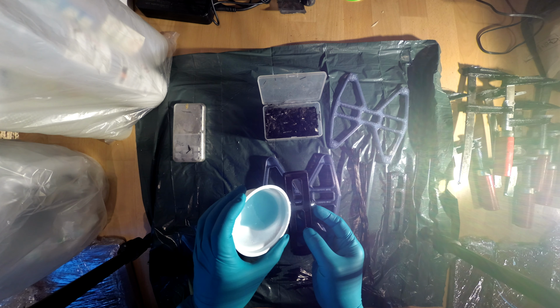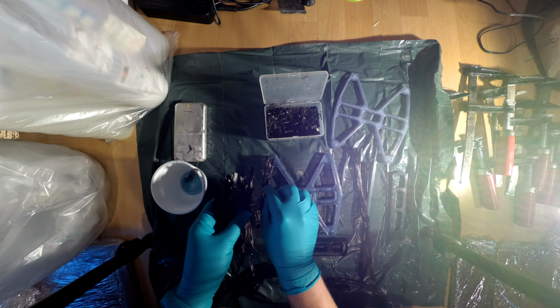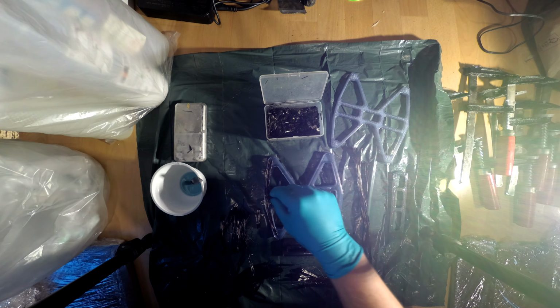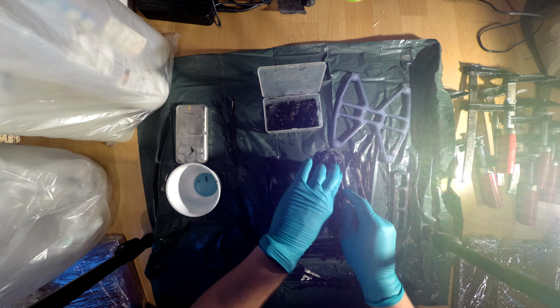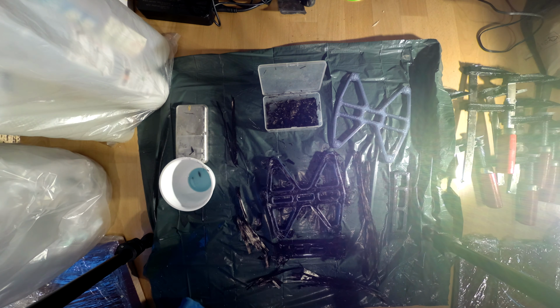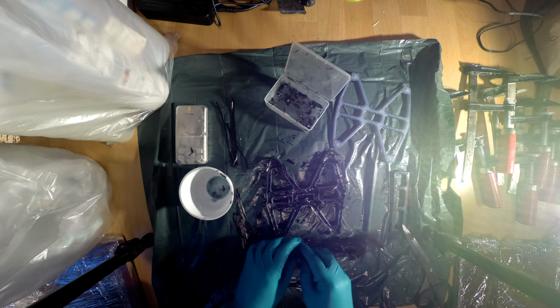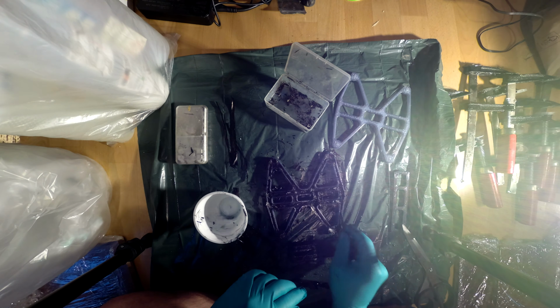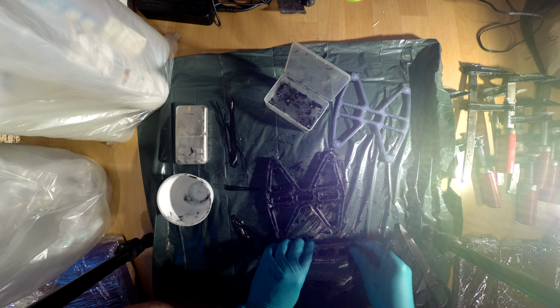Step 5. Prepare the mold with some resin and stuff the carbon fibers in it. Think about the stress points and the larger segments that need short length fibers, and try to fill the mold evenly according to the geometry of the frame. It should look like it's overfilled when it's done right. Then put the top part of the mold on and slowly squeeze the mold with some clamps or a large vise.